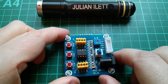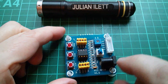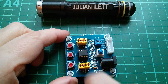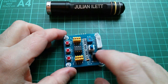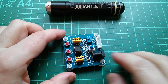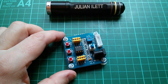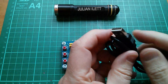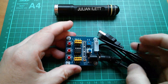The reason I've chosen this board is because it's easily available on eBay. It's not terribly expensive and it has a good old-fashioned 12F675 microcontroller, so there are no complexities here — it's all really easy stuff. This board does have a few issues, so this video is going to be about solving those issues and also providing a general shopping list of things you may need for the PIC programming assembly language tutorials. The board also comes with a USB type A to 2.1 millimeter plug cable, which is quite convenient for powering it.